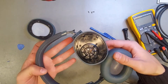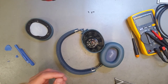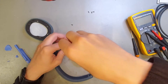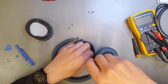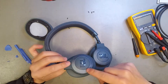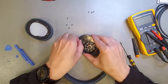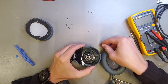After breaking all of my tools, I can finally see the other screws. These are Phillips head screws, so you should be able to open them easily. My main concern is the connection between the two headphones, because the power is on the left side and the cables go to the main board, and the main board doesn't have any power — so I'm thinking the cable is broken or something. Let's see.